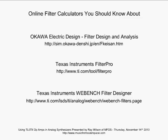A few folks would like to know about LEDs. Can those be used in circuits for visual feedback? Oh, absolutely. You can drive LEDs with the outputs of op amps. I would reduce the current somewhat so that you get a faithful representation of whatever you're trying to amplify. But the output of an op amp can be used to give you a variable brightness in an LED very easily. Just hook the anode to the output of your op amp, the cathode to your current limiting resistor, which I suggest is at least 2K, and then experiment. And that LED should glow just fine as the voltage increases or decreases. Or, well, not when it decreases, but only when it's positive.